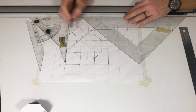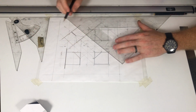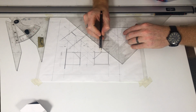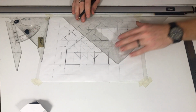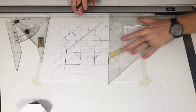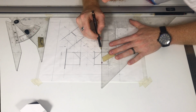But now I need these other interior edges, which I'll have to bring down from up here. And again, I'm going to draw freehand, don't do this, right? But we'll use this as an example. The way the material is, there's a little corner there. So that's something I could draw. It's pretty small to see with hidden lines, but I can just quickly get a little bit of a projection on it to find out where it is. So we'll take that corner, project it back.